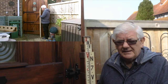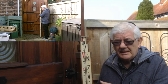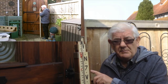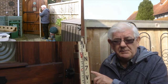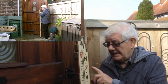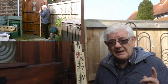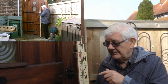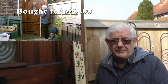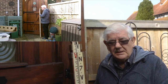You can now get metric staffs. I think metric is actually easier to read because there are fewer divisions on them. These imperial staffs are cheap as chips because we don't make them anymore and there are thousands of them out there. I got the staff, the tripod, and another level for the whole lot for £30 — less than buying a decent Stabila spirit level.